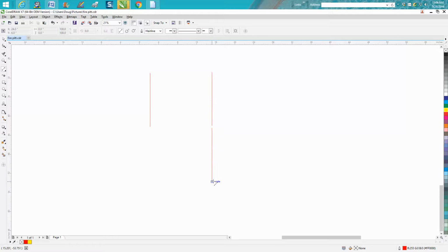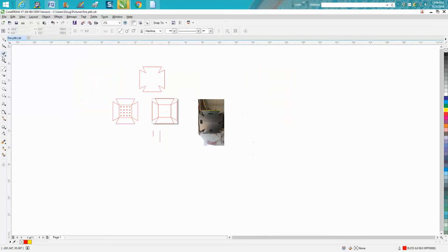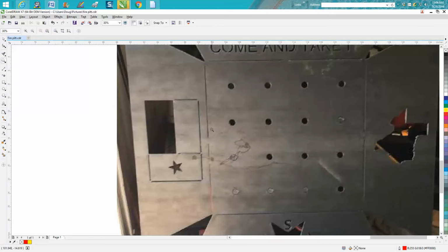And what that is, it's 24, and we want a 1/2 inch space at the top, 1/2 inch space at the bottom, and 1/2 inch space in the center. We want a 1/2 inch, because what he did, he left some places so the sheet would still stay together, and I'm just guessing a 1/2 inch. With a little bit of heat, you could bend that up quite well, and it'll bend pretty straight. And my suggestion would be, and I think he even suggested it, you don't even have to weld this because you want the water to run out.